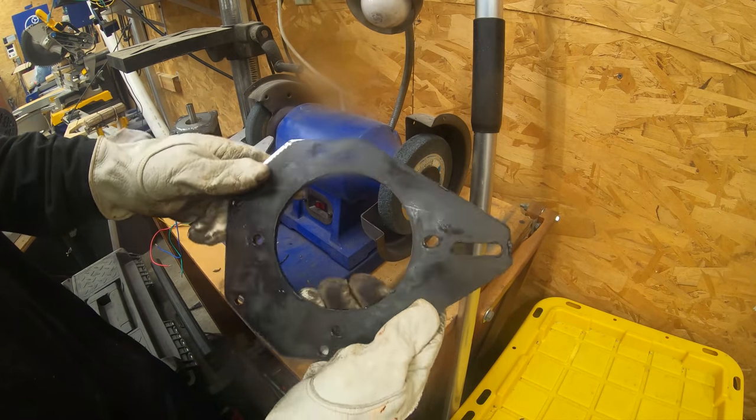I have a brand-new unused saw blade and a relatively new saw — maybe a couple months old. We're going to re-run the earlier test to try to get the original universal motor down to 1500 RPM and see if we can cut steel. We've got 60.8 volts coming into the saw. It takes a little longer to get up to speed after pulling the trigger. It's really bogging down — it's just not able to do the job. I'd prefer not to ruin this blade by forcing it. We're also going to set it up with the DC speed controller and give that a shot.